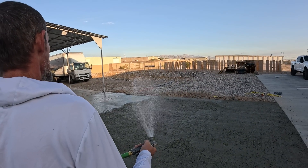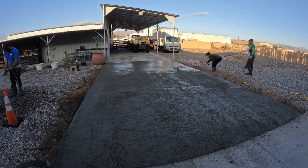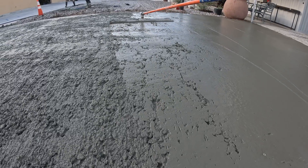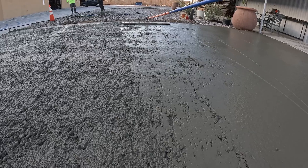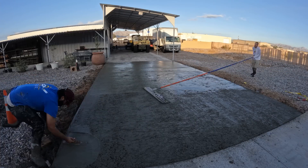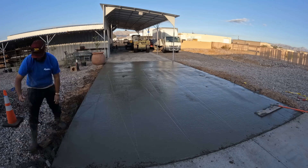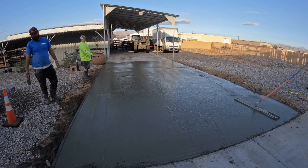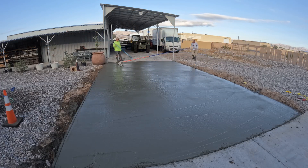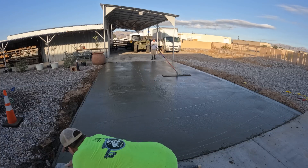We have Joe here — he's a concrete finisher, came out just to help us out a little bit on this one. I did get a roller tamp, by the way — got it at Decorative Concrete in Las Vegas, great deal. Didn't use the roller tamp on this because I hadn't quite got it yet, but after pouring this it was time to pull the trigger on buying one. I think it's going to make it a lot easier laying these down, a lot less bull floating, and the rocks are going to get down a little bit and bring up more cream. Easier all the way around.